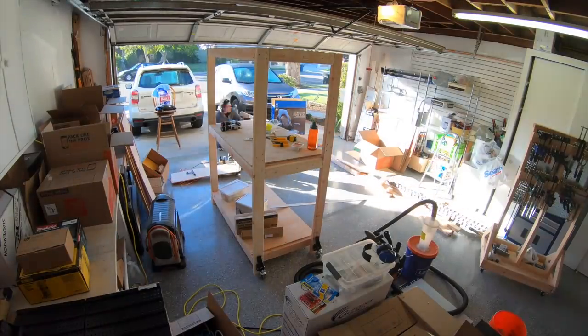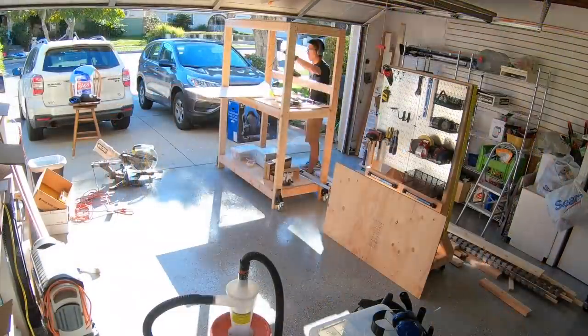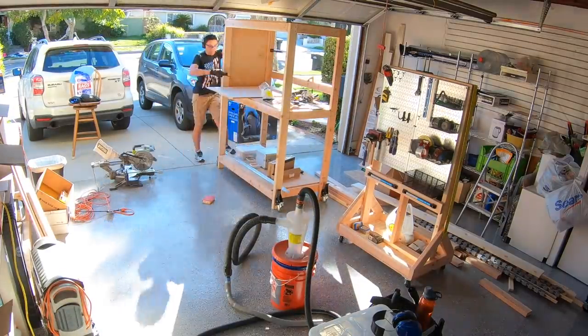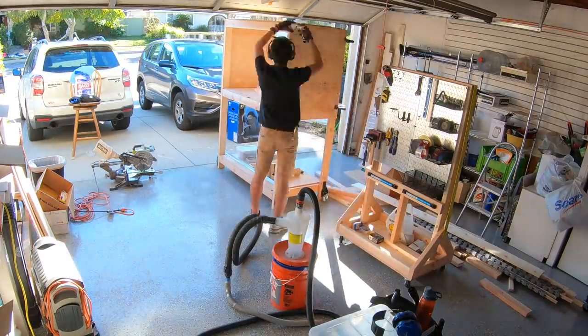If I'd looked into plastic suppliers who could cut sheets to custom lengths, I might have opted to get Lexan panels that were maybe 24x30 inches tall. I decided to do the next best thing and use a hinged 1x6 board at the top of the enclosure to preserve my head clearance and drop the Shapeoko shelf and doors by 5.5 inches. I was a lot happier with this new height — it was comfortable and accessible.